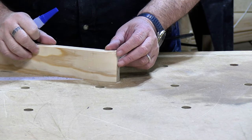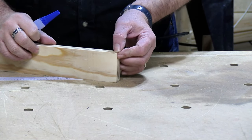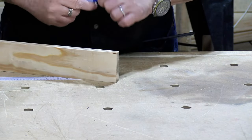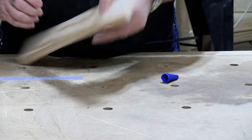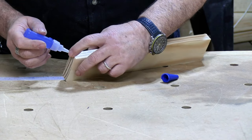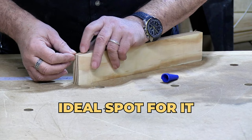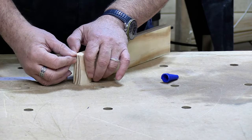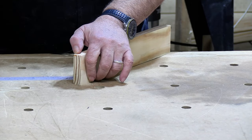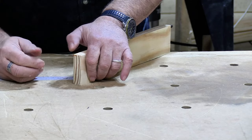I've got a chip that's trying to come off on one of the ends of one of my pieces, and fortunately I saw it before it did come off. I'm just going to attach it again with a little bit of super glue — cyanoacrylate adhesive. We don't use CA glue all the time in woodworking, but this is an ideal spot for it. CA glue works really well with wood because wood already has a moisture content and CA glue needs moisture to set.